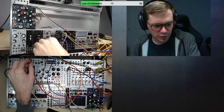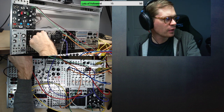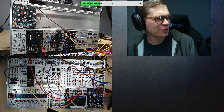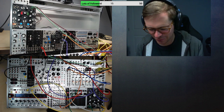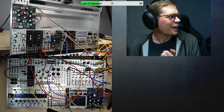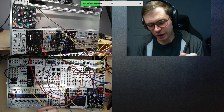All right, so then coarse tune, it said dampening to maximum. Now patch a dummy cable into strum and pull out the strum dummy to trigger a long note. Well, we can just trigger it from the Tetrapad. That's fine. And then tune the frequency attenuator. Yes, then you turn frequency to get close.